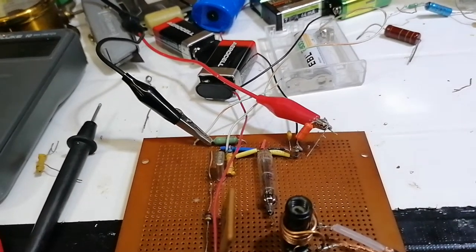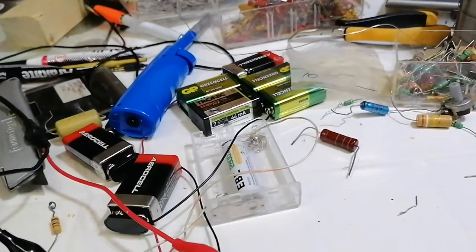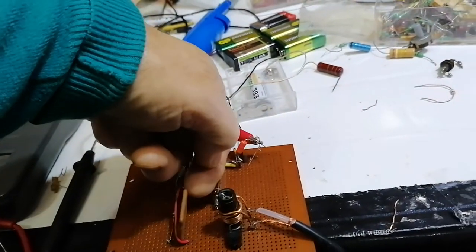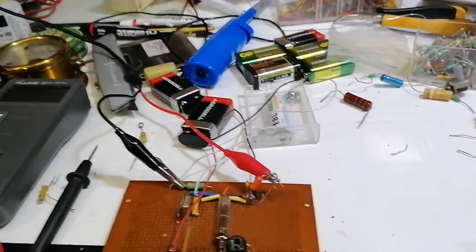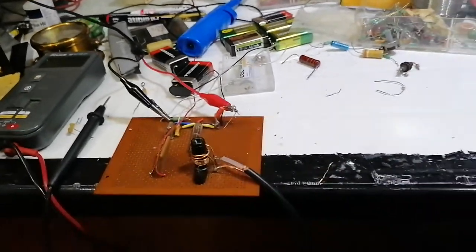It needs a little bit more than the pantry transmitter for medium wave, but that's fine. We're still continuing on with the 1.25 volts from the valve. It's stone cold - I can't feel anything from it. I need to check the current, but I don't think the current will be any more than a milliamp. It'll be less than a milliamp, I'm sure, but I will check later.